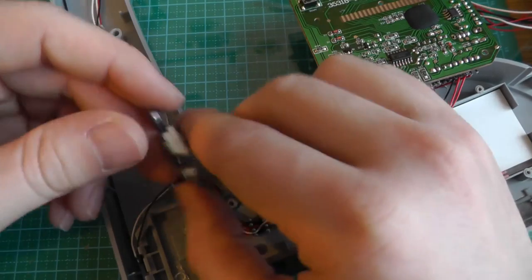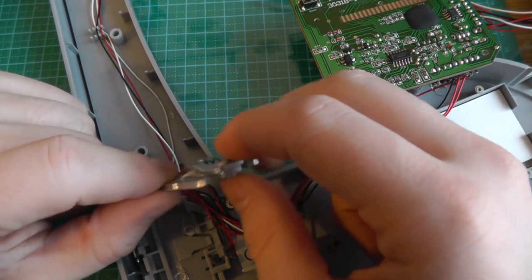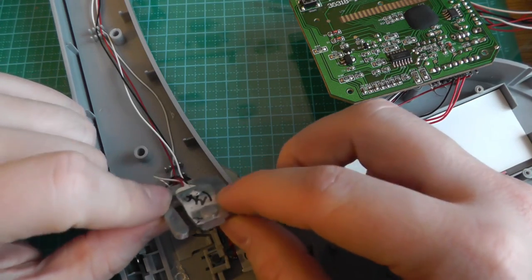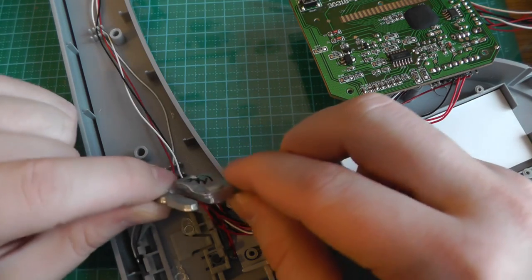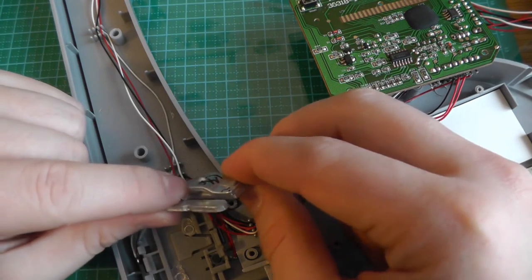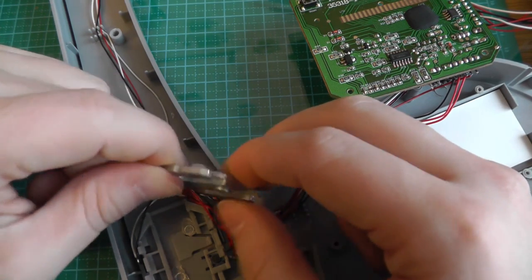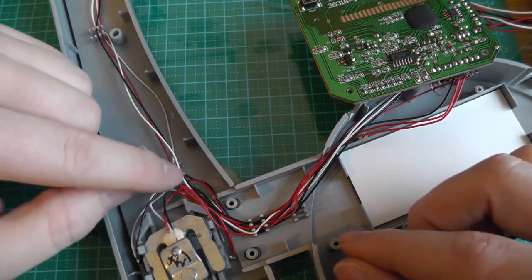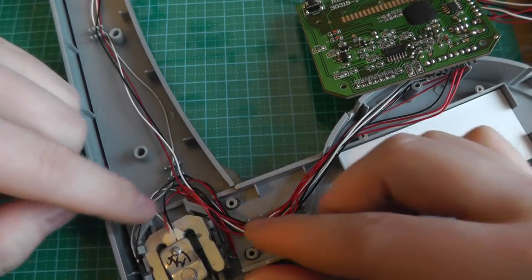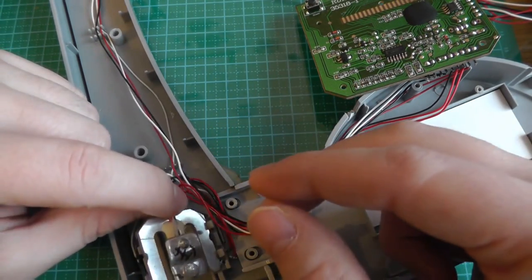And 4. And how this works is that whenever you apply pressure, so this is just bare metal, and on the bare metal you have 3 wires. What's under the bare metal is just some resistors. And the idea is that when you push on the metal, because of the weight, you will deform it, you will distort it. One side will get compressed when you push hard on it, and the other side will be expanded. And this changes the resistance of the metal. So what they do here is they just take the resistance, and then it goes to the op amp, and the op amp amplifies this subtle difference, so you can really measure the weight using that. And this is how simple it is.